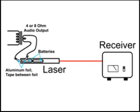All the way over to the right is the receiver. In my original science project, I used a photo cell with a battery to generate a signal. In other words, the photo cell would change resistance, and the battery supplied the power source. I just used an audio amplifier to amplify that changing voltage.